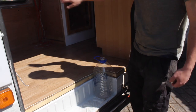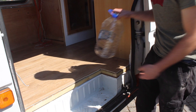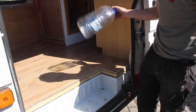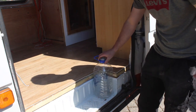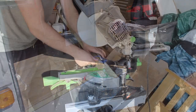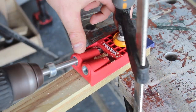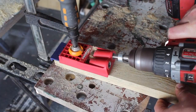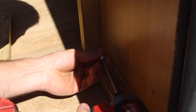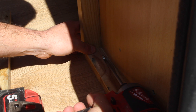I need to build one more base unit, going across the door slightly. I want to utilise this space for taking a clean water container in there — you'll be able to access that from a little door. I build the sink base unit out of 25mm roofing batten, a common material I've used throughout the build. It's joined together using a combination of pocket hole screws and glue to make a nice strong construction to support the baby Belfast sink. I do love this pocket hole jig — it's very handy.